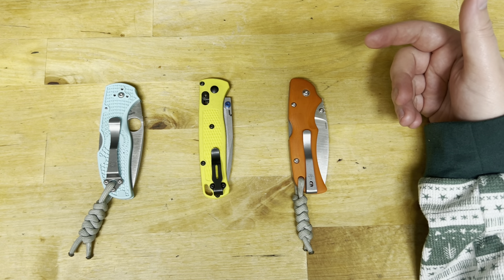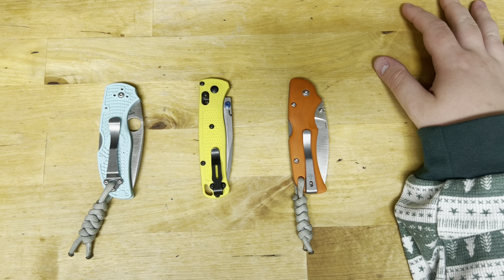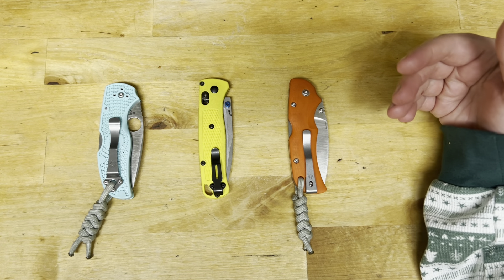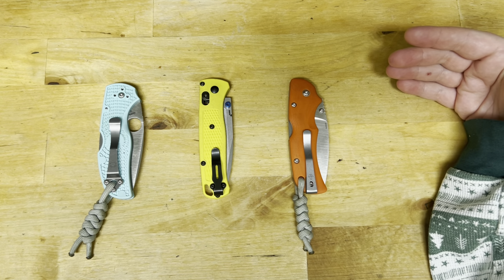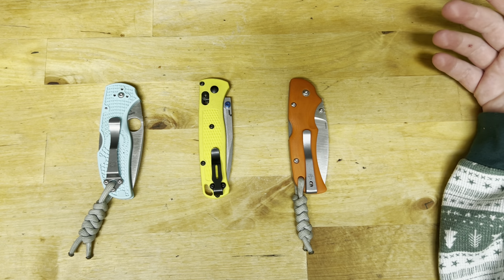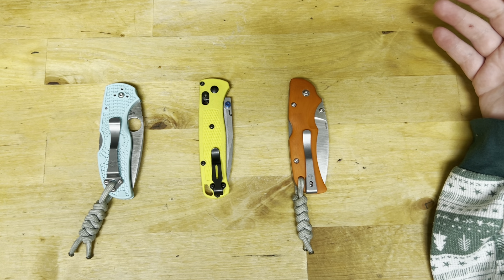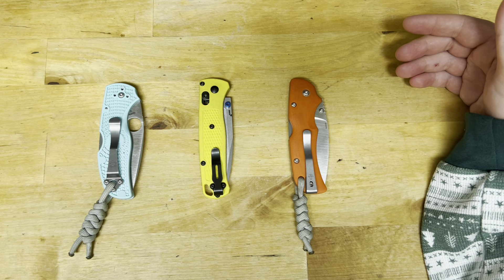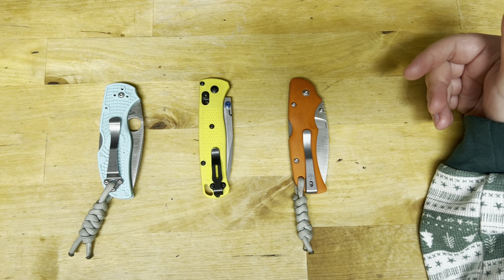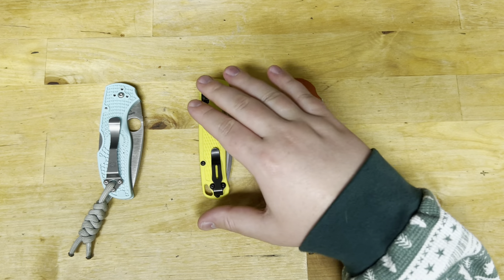I can see why it's not offered on every single knife. It did feel like a lot of the attributes were super similar to S30V, except for the edge retention. Manufacturers aren't using it everywhere — not to mention it's more expensive to grind — so I can see why they're not putting it in a folder for everyone. S30V just holds up a little better in terms of stropping, it's easier on the machines, and it's cheaper. So I can see why S90V isn't as mainstream.